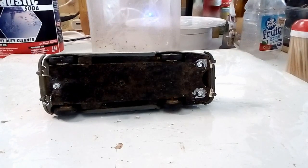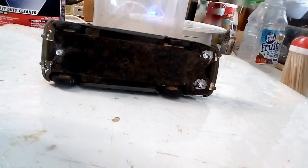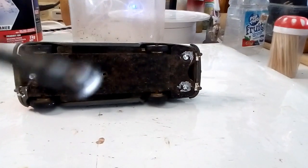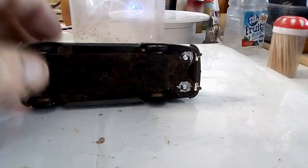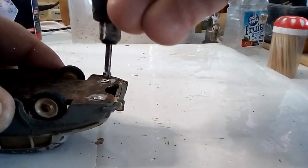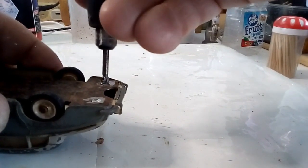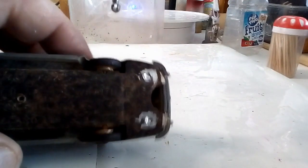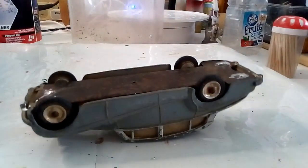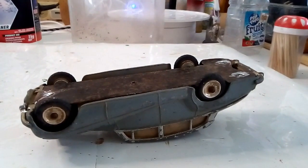Okay, so that, without having to make a lot of noise for you guys and gals, is that I've used the burr tool on the end of the pretend Dremel, and all I do is find the middle and I go out towards the end, and then I just let the tool stay in the middle to make a small indent to what you see there, and that should make it easier should I decide to drill down, and which I haven't done yet, and tap. I haven't tried that yet like the others. It will happen one day, but for the moment that's enough.